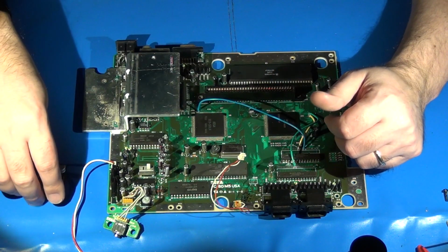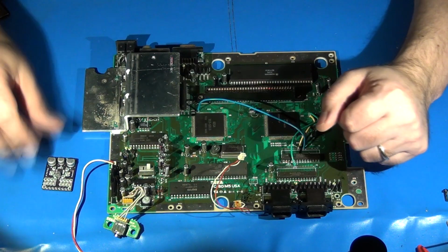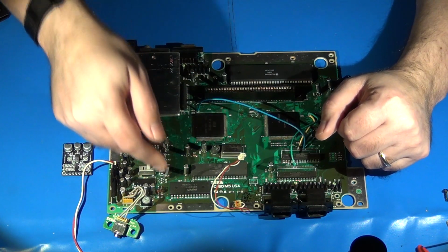We're not going to need it anymore. So as a result of this, to get the cleanest unfiltered sound you can through this little guy, which is what is recommended to do, we're going to be removing these 7 input capacitors right here.